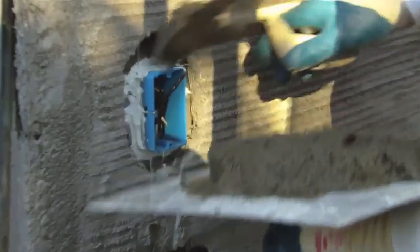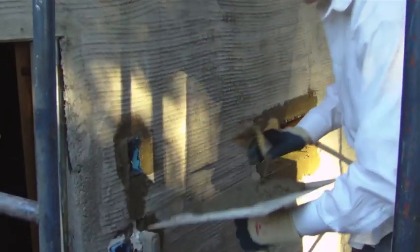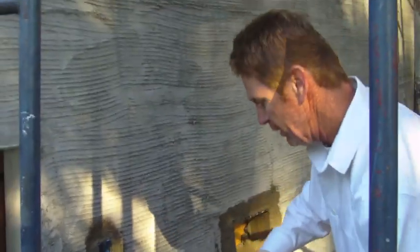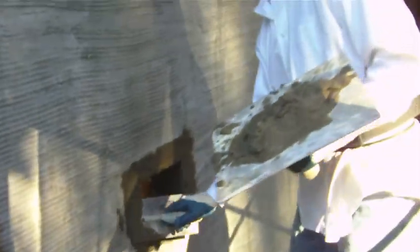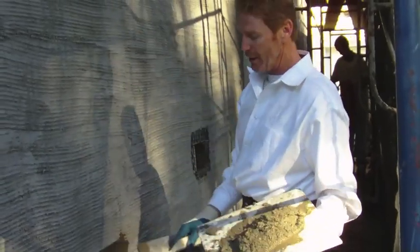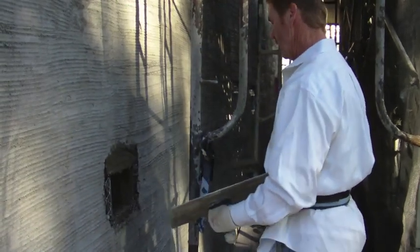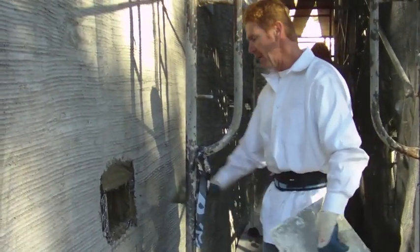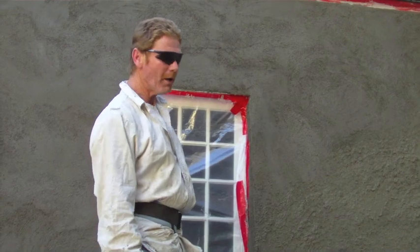Now that we've broken this out and put some polyurethane caulking on it, what I'm going to do — prior to doing the brown coat — is apply mud that has accelerators in it. By the time I go to the top and do our work up there, this will have had a chance to set. So for example, this area I just scratched out will be set by the time we come down here to accept the second coat. This has aluminum in it. I'm giving it all a chance to set so when we get to that stage we can bring it all down and brown this out.